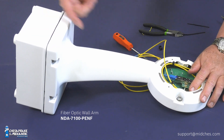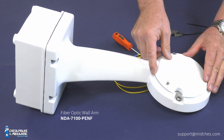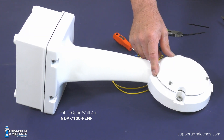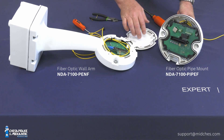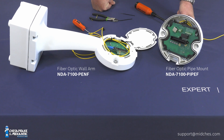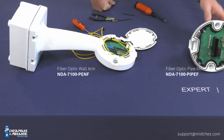Once you're done, put the cap back on and tighten your three screws all the way up. Don't break the screws off in the casting, but tighten properly — this is weather protection. The cap has seals around each screw, plus a grommet and gasket around the lid. Don't forget you need a security bit for this. That is effectively how the fiber optic connectivity works in both the pendant mount option and the wall mount option.